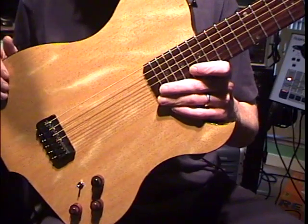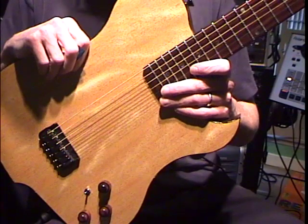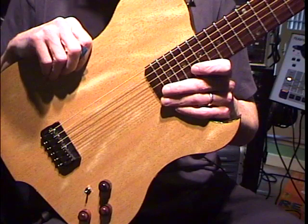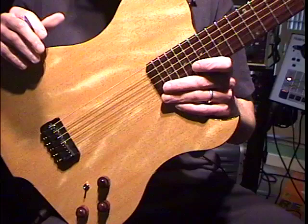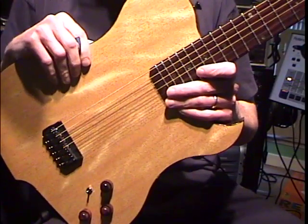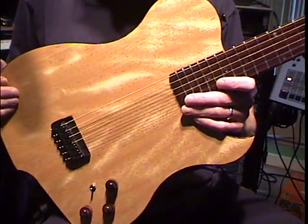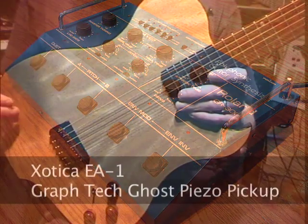And my understanding, I hope this isn't just some internet rumor, was that Roland had changed the input jack board on the VG-99. The previous versions contained a high-pass filter that basically filtered out low-frequency energy coming from the guitar before it got to the electronics. With the VG-99, they cut that out, and as a result you got too much low-frequency energy coming through. Now, the most problematic patch for me was the GR300, because the GR300 processes the string sounds directly, so if you have that low frequency energy in there, it just doesn't work right.